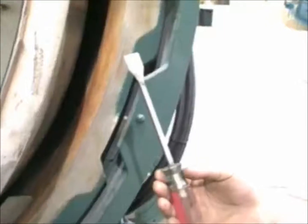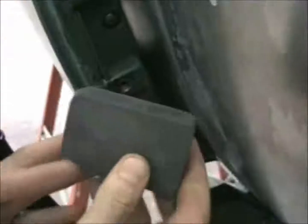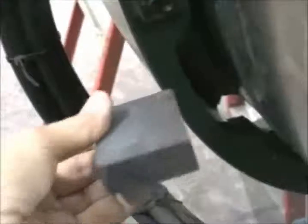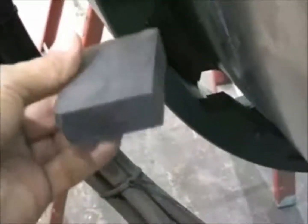To help us get the glide block out, we might have to tap from the front side of the vessel while we're pulling the glide block out from the back. You can only do this if you take the load off of the glide block. The back of the glide block is rounded. Sometimes the corners will be rounded, but more importantly, the face that touches the ring will be curved, as this mechanic is attempting to show us here.